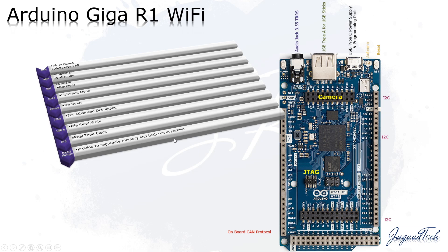We can find more details on the Arduino website, which has very good documentation. It also provides a lot of features on the communication protocol side. Wi-Fi can be configured as a web server, AP, or Wi-Fi client. It also has MQTT enabled, which can be utilized as publisher as well as subscriber, and there is also the UDP protocol for sender and receiver.